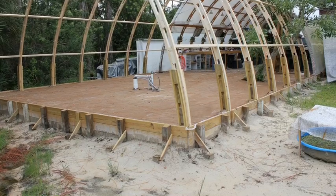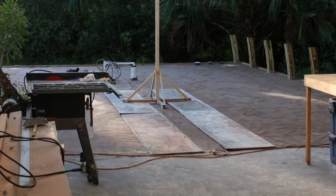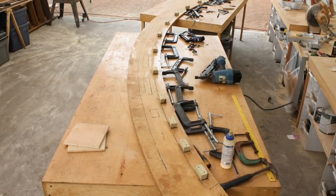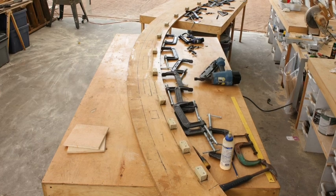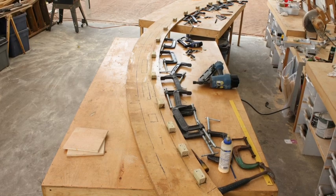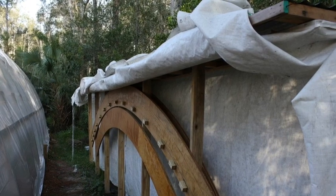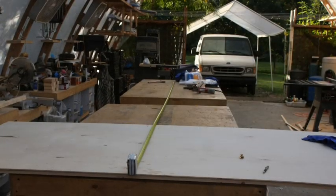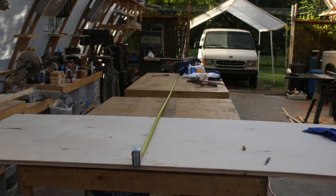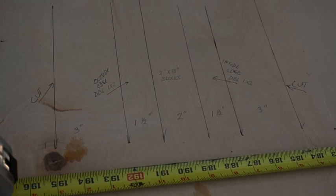The first thing to do when building this is we had to build a 16-foot radius jig to lay these arches up on. We did this by laying out a piece of plywood with a tape measure and turning a pivot point, scribing out the inside and outside line of the 16-foot 2-by-6 arch that we built. Here are my arches laying up on a wall rack. Here's the table piece of plywood and I'm turning my arch.